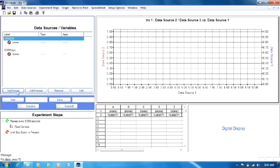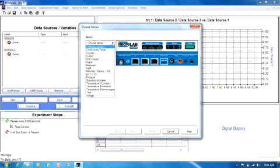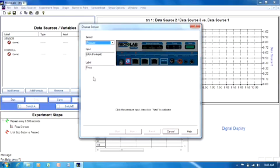So I'm going to go over here and click in the upper left-hand box, Add Sensor. We have a drop-down menu, along with a cartoon of the front panel of the Microlab interface, and I'm going to choose the pressure sensor. Notice the label is pressure. We also need to click the input. So the pressure indicator is right here, but to really tell the software that we've got the pressure sensor hooked up there, we're going to click on it. Notice it changes color when you do that, and we get a new thing that says next to calibrate.